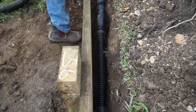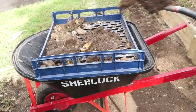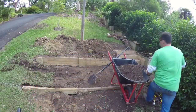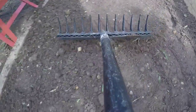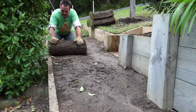For the drainage, I've run the pipe through — just stretch it out, add some gravel on top if needed, then lay filter fabric down before backfilling with soil. Here's a tip: use an old bread crate on top of your wheelbarrow as a soil sieve to get rocks and roots out of the soil you want to reuse for the pathway. Use a landscape rake to spread the soil — the back of a landscape rake is actually designed to help you get your soil level.